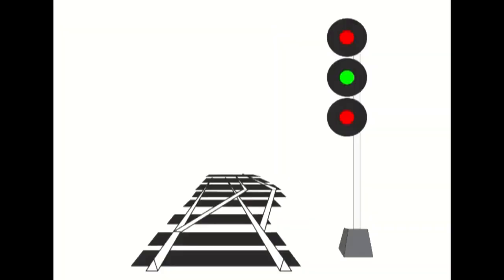But let's up the speed a little more. Let's make switches with really long curves and turnouts designed to be taken at 45 miles an hour. Again, this is a new speed with its own new name, limited speed. So you might be able to guess what the designers did to show the train operators how they can take the switch at 45 miles an hour. That's right, they upgrade a pre-existing signal. Now there's really only one speed they could upgrade, and that would be medium speed.